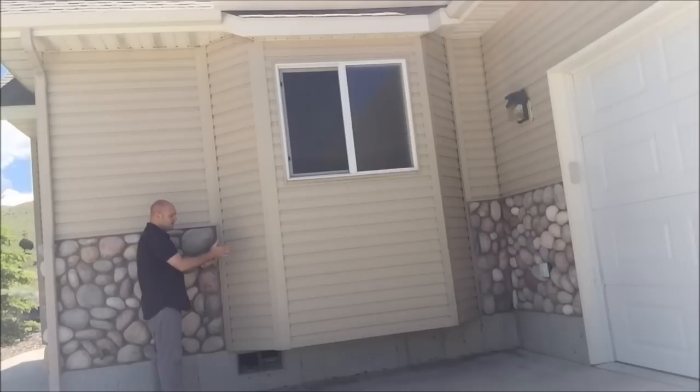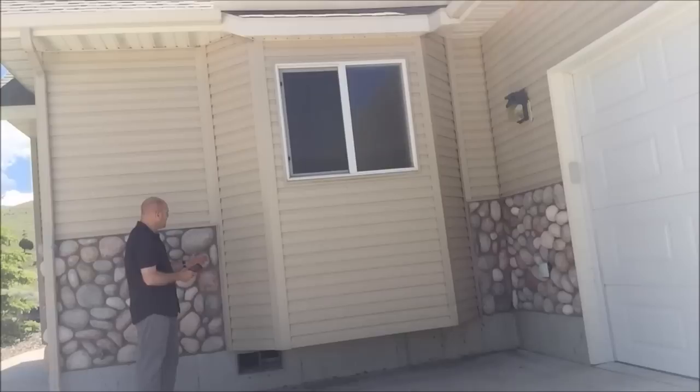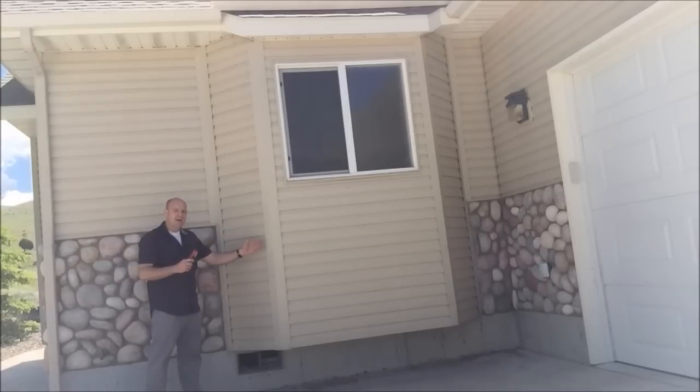So what I'm going to do is hold my disto laser measure straight against where this wall is and do a quick measurement — and I've got one and a half. Then I'm going to abut it, eyeballing right where the wall comes back, and measure it — and it's one. So what I would do on my sketch is come out one from the wall as if it were a right angle, but not anchor it, and then shoot this way one and a half, and that point I'll anchor — and it will give me what I need as far as the angle goes.